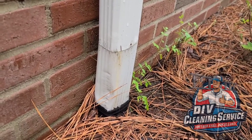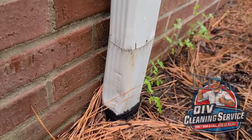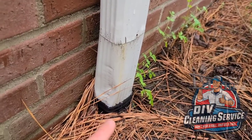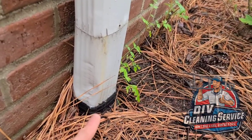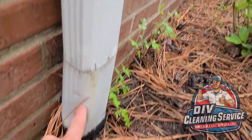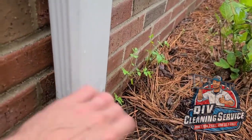This is a great example of what it will look like if your downspouts are connected to underground drains and the underground drain portion is clogged up. See how the water is backing up out of the drain? It's coming out from here and the connections in the downspout.